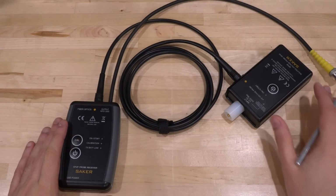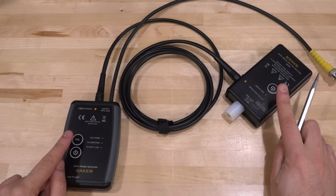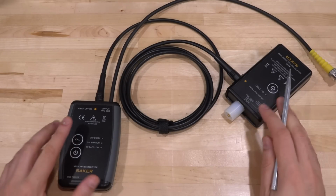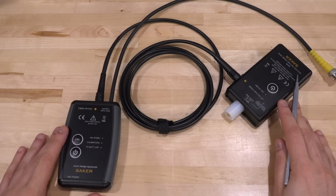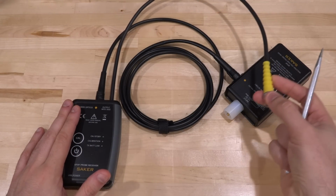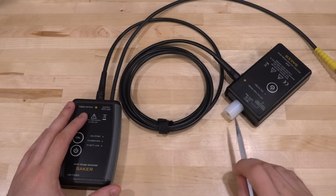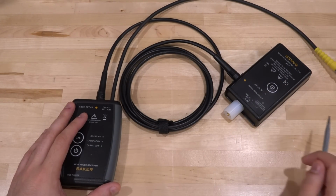It means that we have a probe head here on the right side and a probe body on the left side, and the only connection between these two is a fiber optic that runs between them, nothing else. So they're fully galvanically separated from each other. The probe body itself can then be connected to an oscilloscope or spectrum analyzer via a regular connection, and whatever you need to connect to the other end of this SMB connector, which we will talk about.